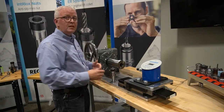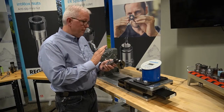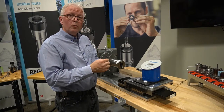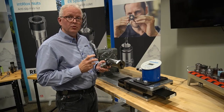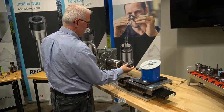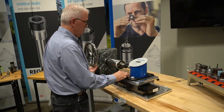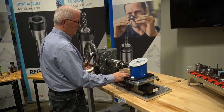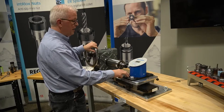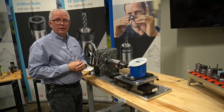Let's take a look at our tool holders. To recap, this is our tool holder with the torque pin not touching anything and that same 100 foot-pounds of torque on the nut. Let's see how this tool does — right at about 90 foot-pounds.